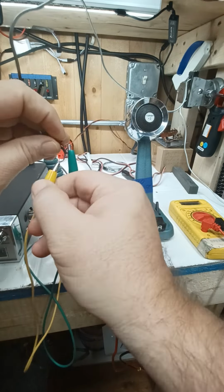Okay, so as you go through those, write those down, what they did. One keyed it, one didn't do anything, one had continuity going through it to the element. Now you know ground, audio, transmit, receive, okay? Then you can do it one of two ways, and the second video is going to cover this some more.